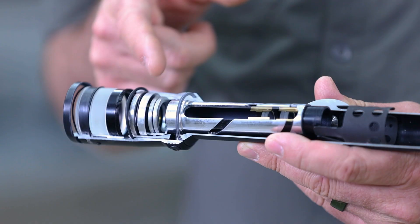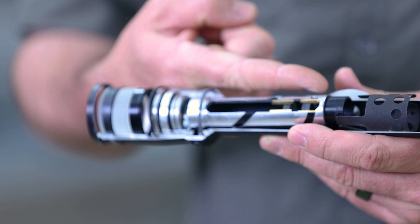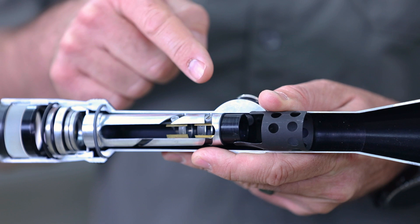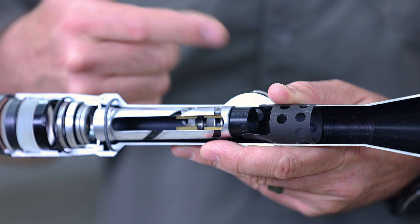As we move forward you'll see this is a tube here — it's actually on a pivot joint, kind of like a finger that moves up and down on a joint. Right here is where that tube can rotate, and out at the other end is where you'll find your windage and elevation adjustment knobs. They're actually moving this tube inside of our outer tube to change our point of aim. That's how we get a scope zeroed to a rifle.